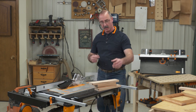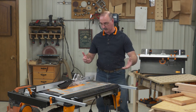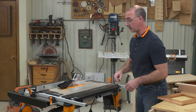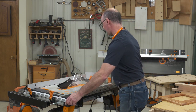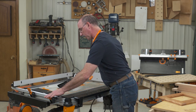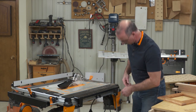Now I was talking about jointing — what's the deal with that? Jointing is a process that gives us a nice clean edge. We're going to use it to take the saw marks off. Additionally, it makes the edge nice and straight, and that's a really important step in woodworking. We want to start with straight edges if we want to produce straight material.